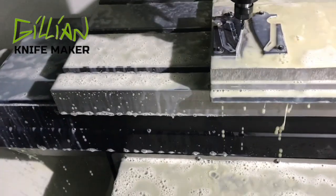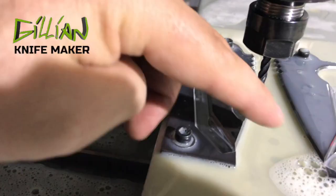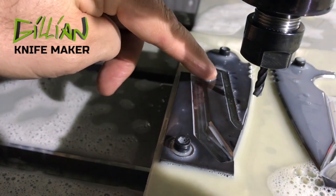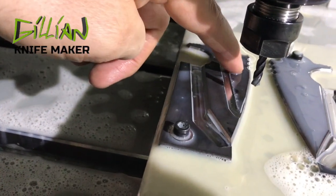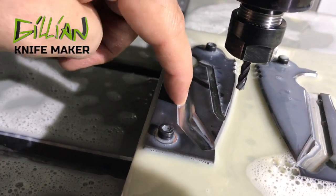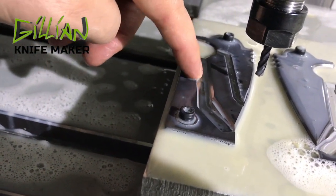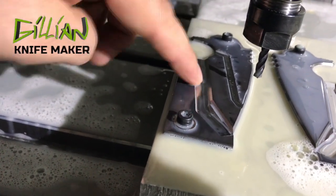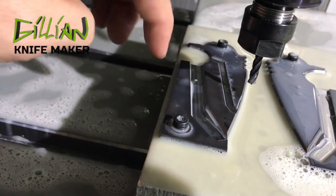Just so you can see how I'm machining this — I come in at the false edge at the tip and work my way down the bevel and out the plunge, stepping down from the cheek to the cutting edge. I machined this pocket to give room for the 3/8" end mill to come in and machine the finishing bevels, which start at the cutting edge and work up to the cheek. That's why I machined out this pocket.